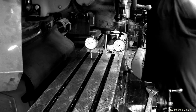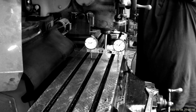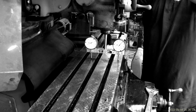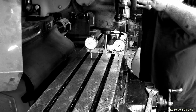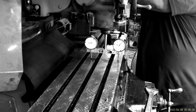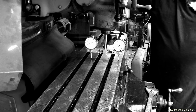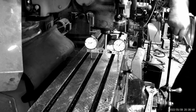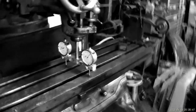To tram the head up and down, what you do is loosen these three bolts. I would suggest that the top one you don't loosen as much — just enough that it can turn. You want to keep some tension on it. I'm going to try to get y'all in a position where you can still see while I can see what I'm doing. Watch this gauge and the adjuster up here.